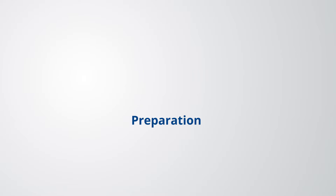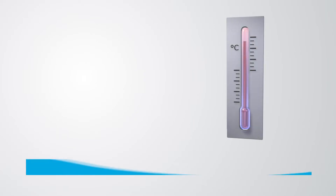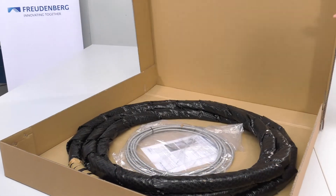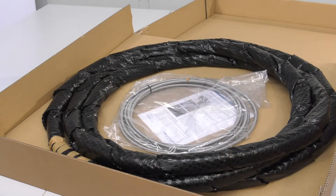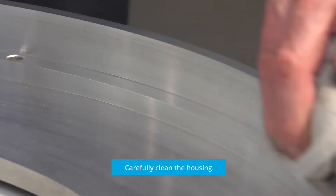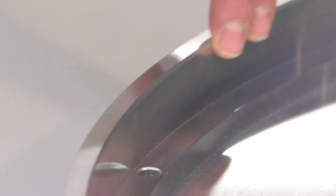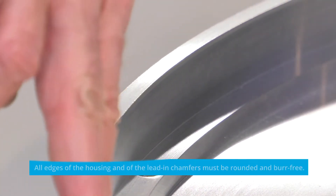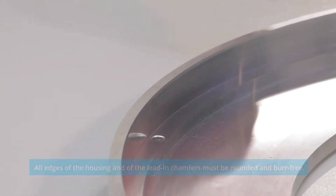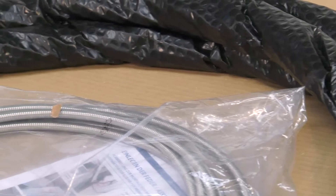Preparation: Before starting with the installation, some preparatory tasks and inspections are mandatory. Bring seals that have been stored at minus temperatures into a warmer place in good time before unpacking. Open the lid of the packaging and allow the seal ring to warm up to above 0 degrees Celsius. Carefully clean the housing with a dry, lint-free cloth and remove any remaining lubricant. Inspect all edges of the housing and the lead-in chamfers — they must be rounded and burr-free.